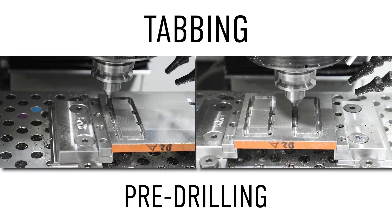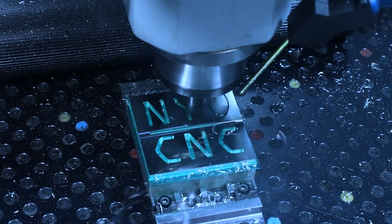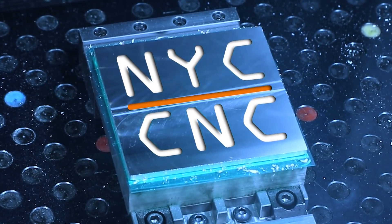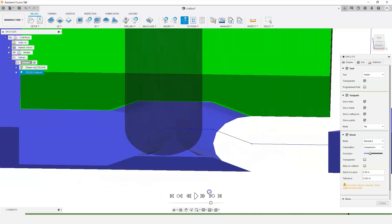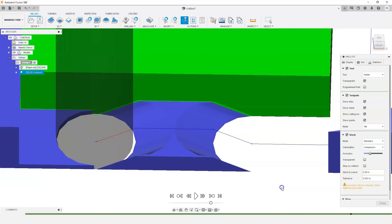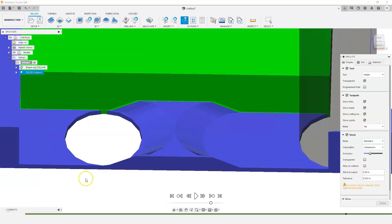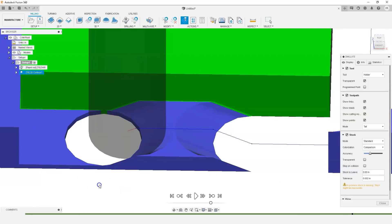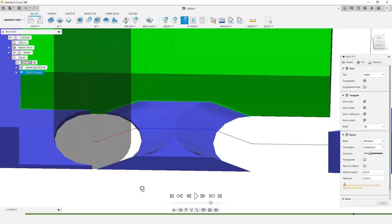I looked into it a little bit and through simulations I came up with a little idea. This is an example of a slot in harder material with triangular tabs. Low depth of cut, but as you can see you have full tool engagement on that lower ramp — pretty aggressive angle. When you pre-drill you're almost side cutting the whole time, which means your cut should be more consistent and more reliable because your load stays the same.